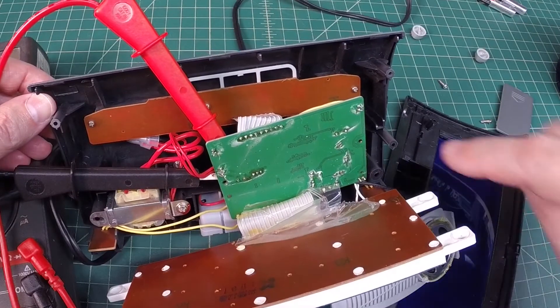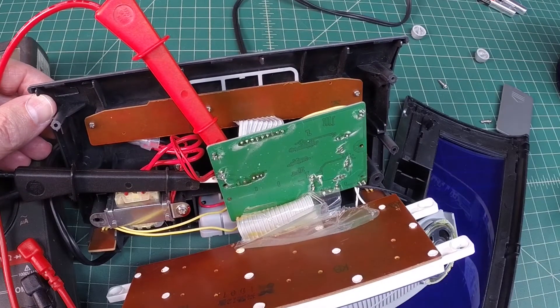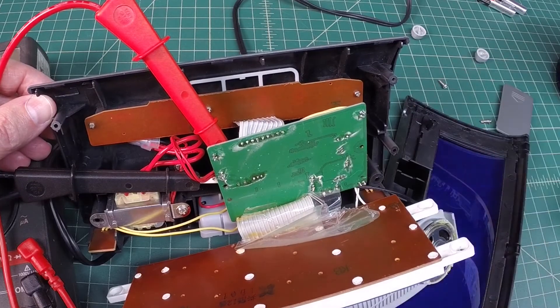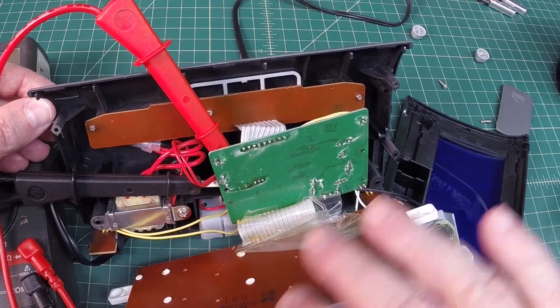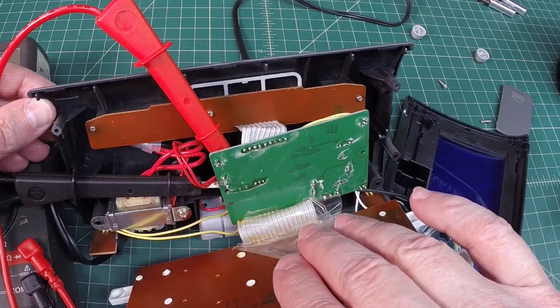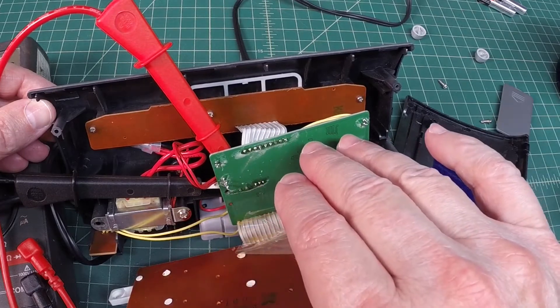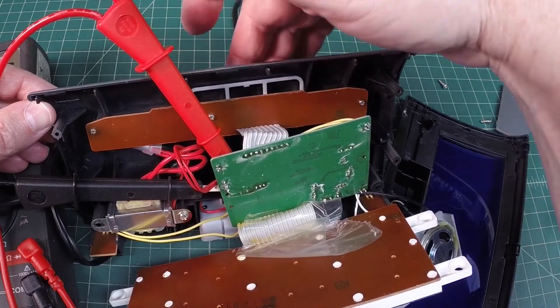I quickly just tried reheating a couple of the solder joints that looked concerning. I'll take some alcohol and wipes in a bit and get the circuit board cleaned up. I need to get the circuit board out, so I'm going to try to leave the display panel attached and detach the ribbon cable that goes back to the control switches on the top.